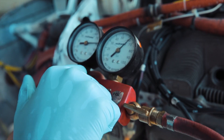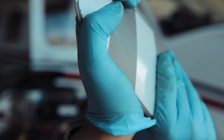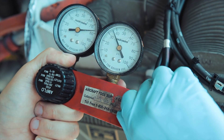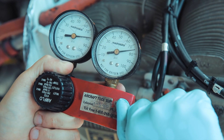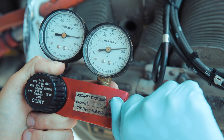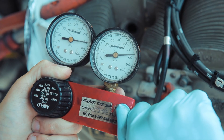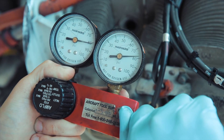My mechanic is holding the propeller so it doesn't spin once I pressurize the cylinder. We are adding 80 PSI — which we can read off the left gauge — to the cylinder, and we're going to compare and see how much of that air it can actually retain. We open our valve and we can see that this cylinder can retain about 75 over 80, and that's the compression for the cylinder.